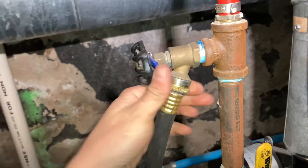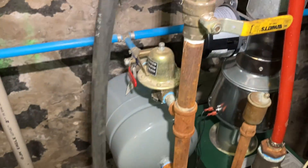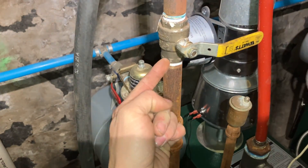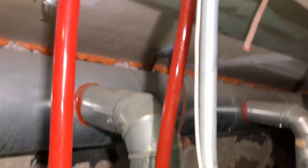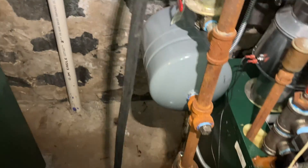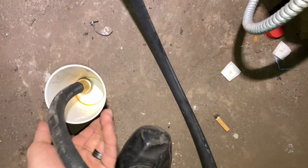First thing we're going to do: connect our hose, power off, close our isolation valve. What's going to happen is water's going to feed in and try to go up, but it can't go anywhere, so instead it's got to go down, through the boiler, up the supply, up the PEX, down the PEX to our drain — and drain its way out. That's how we're going to push all the air out. In the meantime, this cup of coffee came in handy. I want to show you how this works.